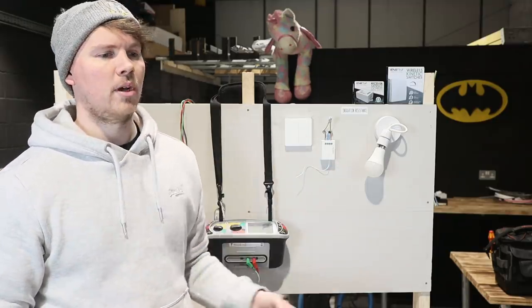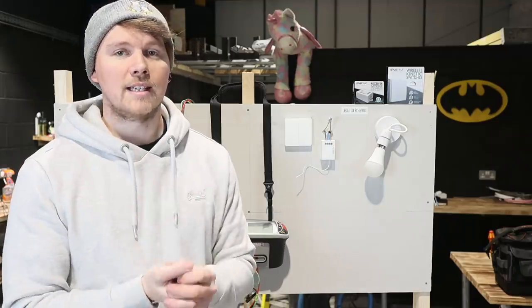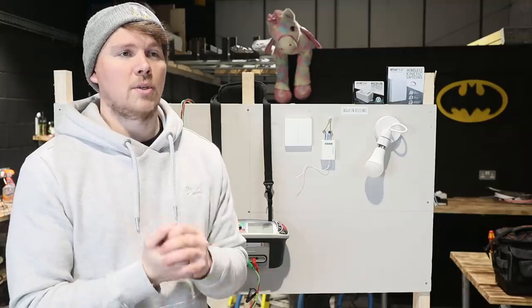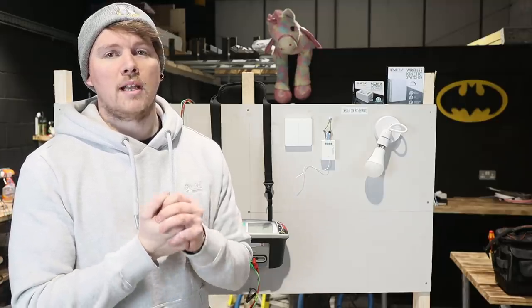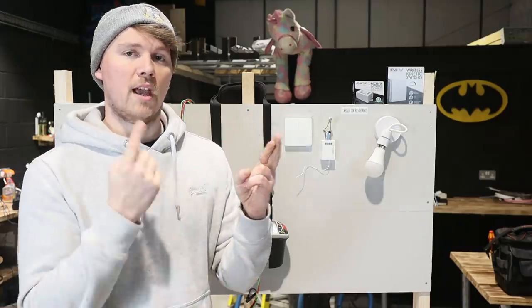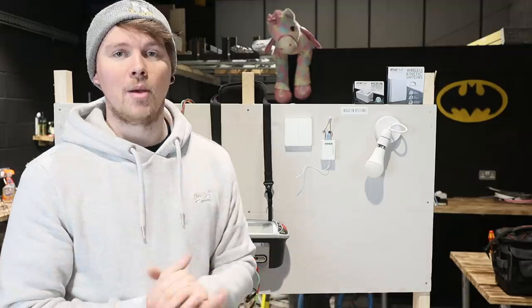I bought a new switch — actually a double one by accident — I've got a receiver, an LED lamp, and I've also been told that when you do insulation resistance tests on LEDs themselves — if we have built-in downlights — we will combine live and neutral together and then test down the earth. This would then break and damage any appliances throughout.